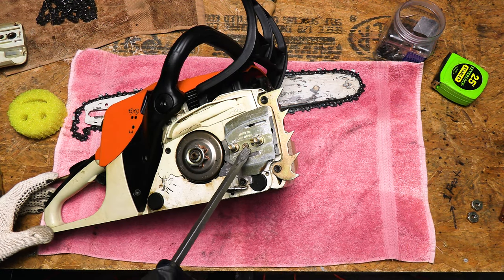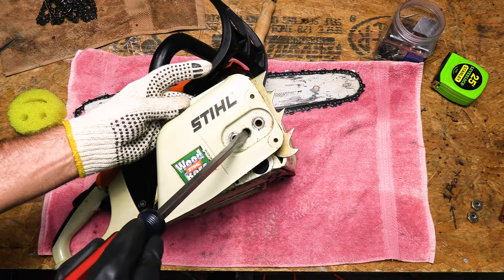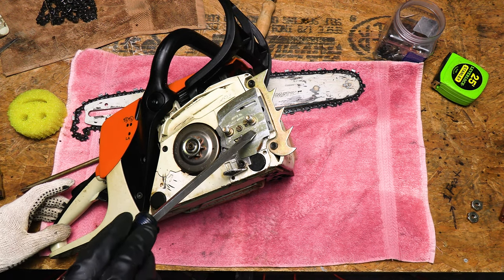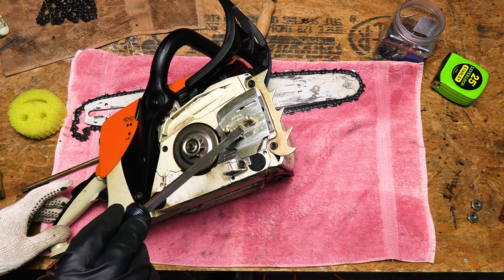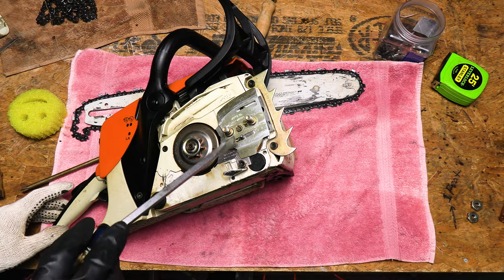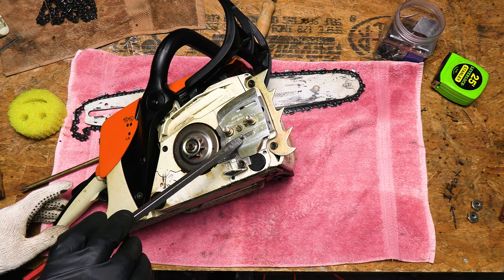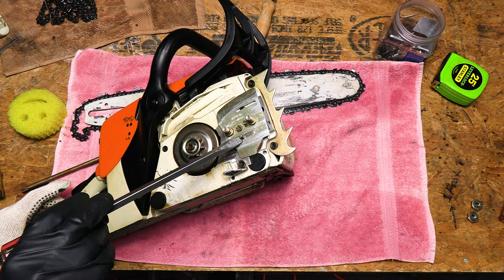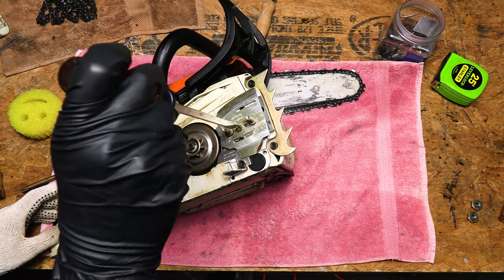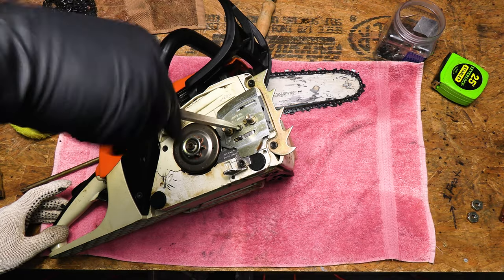This apparatus right here is your chain adjuster. This is where it's at on the Stihl. Usually you can reach through the cover and get to the chain adjuster, and what that does is it moves this pin right here back and forth to move the bar. On some models, it can be in the front over here, but either way you're going to have an adjuster somehow. When you're putting on your new chain, chances are the old one has stretched, so you're going to need to adjust it towards the chainsaw so that it will be loose enough when you put it on there.